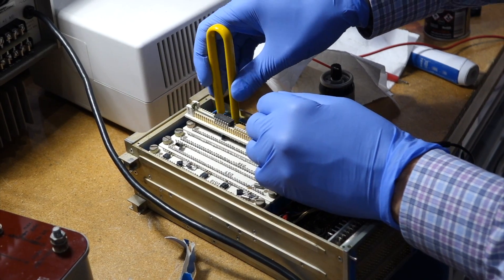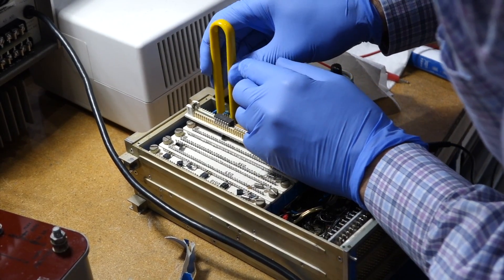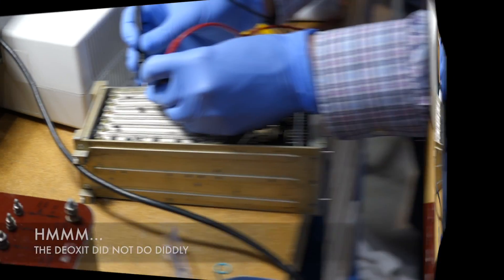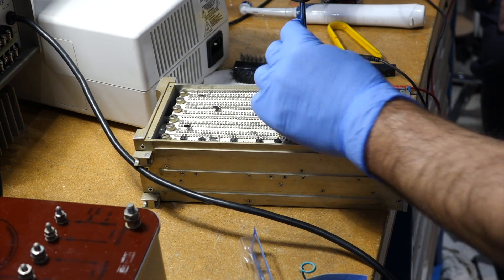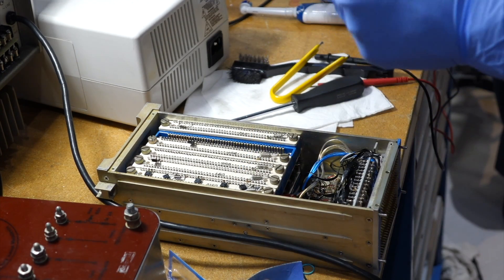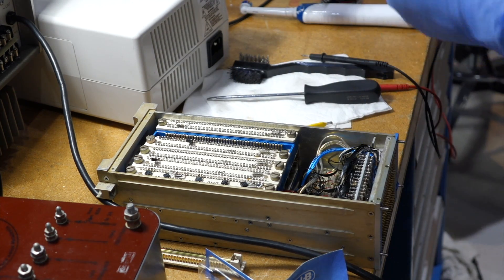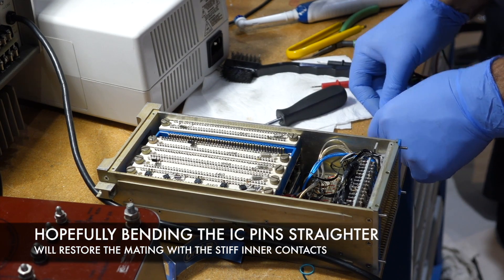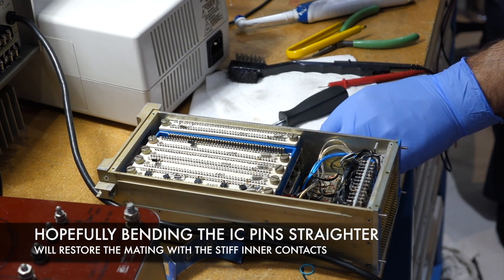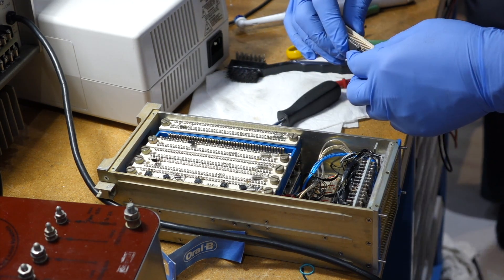I would say just remove every IC and wipe them with a cloth that has some Deoxit. But when I check the grounds, they all seem to be disconnected. My current theory is that it's mechanical — there's spring on one side but almost zero spring on the other, and these are splayed out, you can see it. We need to bend them a little to get them into sockets. There needs to be a tight fit on top — you just bend it straight and that works.